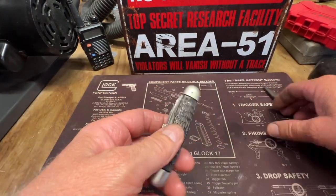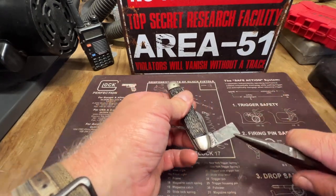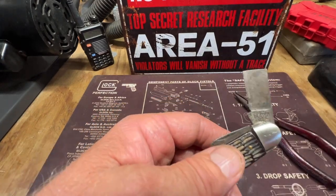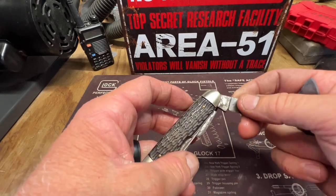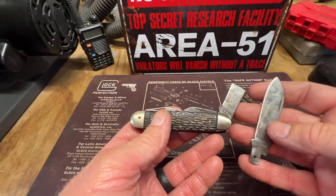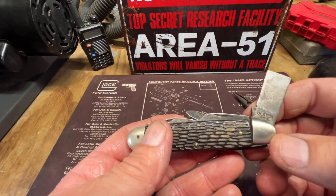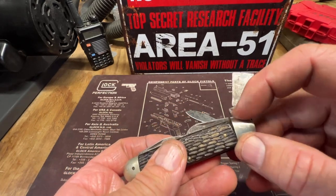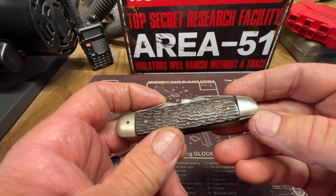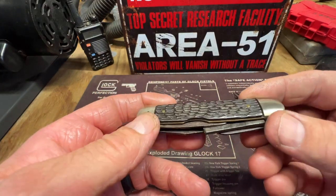This is an Ulster camping knife and the blade is broke. What I'm gonna do is change out the blade with this extra blade that I have, but the problem is there's no pins — you got to take these bolsters off to actually get to the pins. So I gotta figure out how to get them off without really tearing them up.